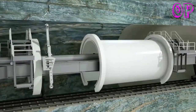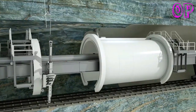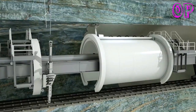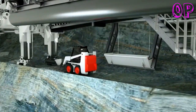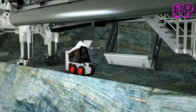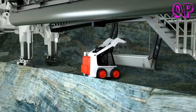If necessary, subsequent measures are taken for permanent rock support of the excavated tunnel diameter in the L2 area of the backup system. Additional rock bolts can be installed and the tunnel wall lined with shotcrete. Water escaping from the rock is pumped away via a drainage system in the invert section of the machine. Cleaning of the tunnel invert is necessary so that invert segments, sleepers, or tracks can be installed directly behind the TBM.